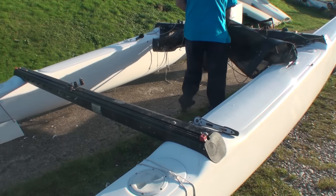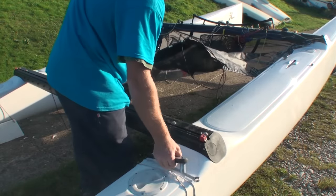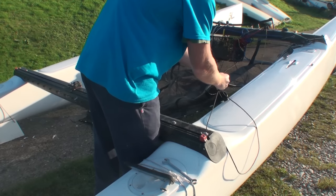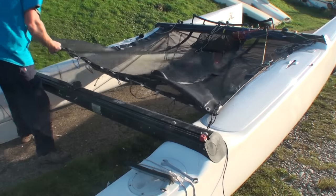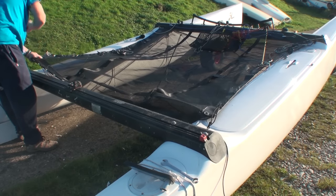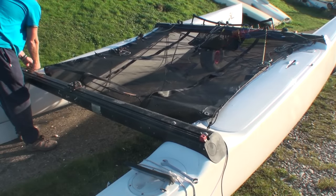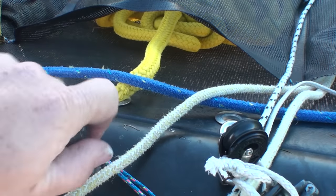She's really starting to take shape now. We unroll the trampoline and first we're just going to tie it loosely using the ropes down the side — this is just to hold it up and make everything a lot easier. In the rope on the side there should be a loop which you can pass your rope through; this will make it a lot easier to get the trampoline tight as we will have purchase. Then we'll do the same on the other side. It's very important to make sure that the trampoline is totally central — you can line up the hole with the mast step on the front beam just to ensure that it is totally central.